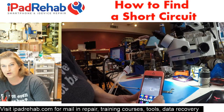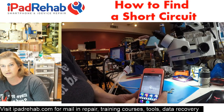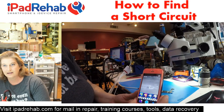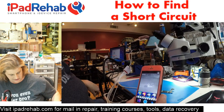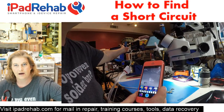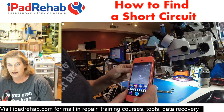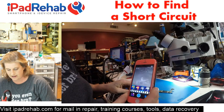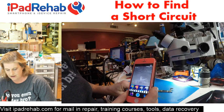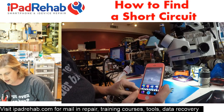So let's go ahead and give it a try. I'm going to fire up this board and we are going to see what the FLIR cam tells us is the hot spot. So we're going to see if we can look for heat using the FLIR cam. I'm going to click on the DC power supply. Right now it is not drawing current, which is normal. And now I'm going to plug it in here at the USB to prompt it to boot. And we are together going to watch and see what gets hot.